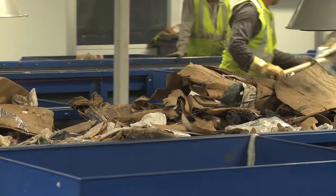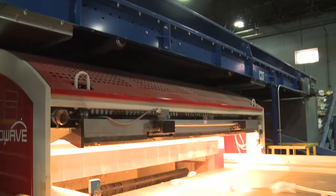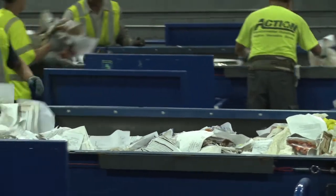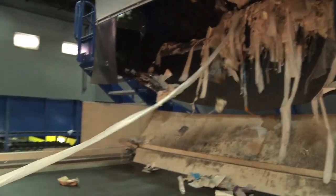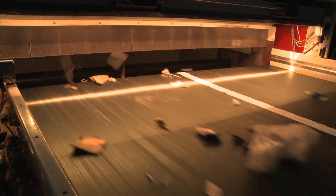And this is where it gets very, very cool. The optical sorting units are the automated tools that will separate white paper from the mixed, or colored paper, magazines, and newspaper from the mixed. There's a whole menu of what these systems can do. An optical sorter works through infrared technology combined with high-speed cameras.